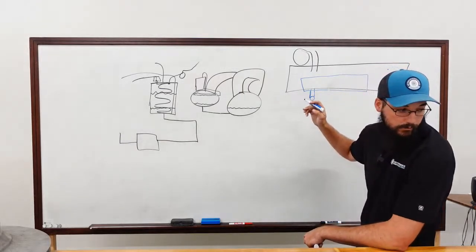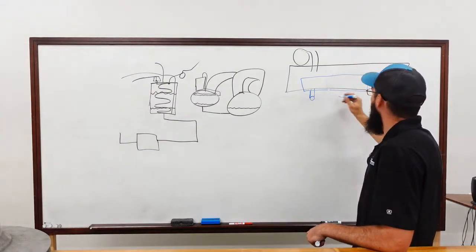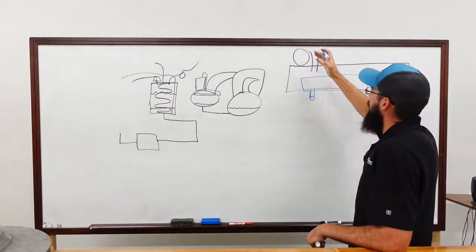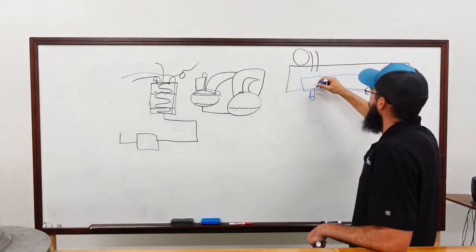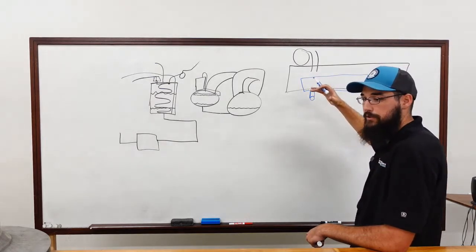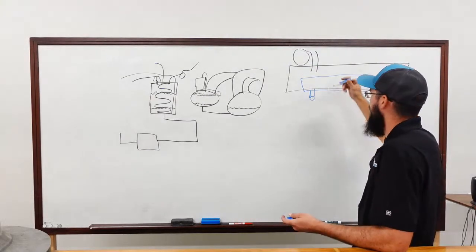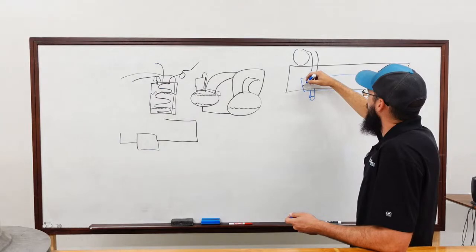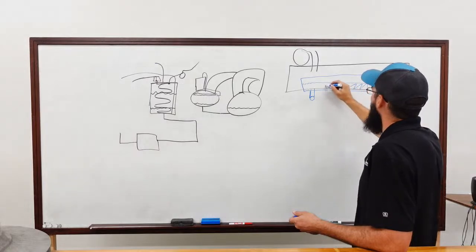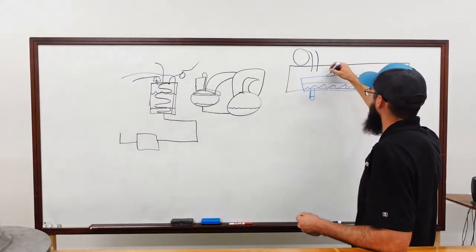So I want to make sure I'm doing this right. Say we have a CVH F, we'll start with that drawing. That means we've got a two-stage compressor. We come into the economizer and we're flashed. We have a medium pressure refrigerant. It's no longer high pressure. It's not truly at our low pressure state. It's at a medium pressure. And so we take that flash gas and it naturally accumulates in the top of the economizer. And our flashed liquid is in the bottom.